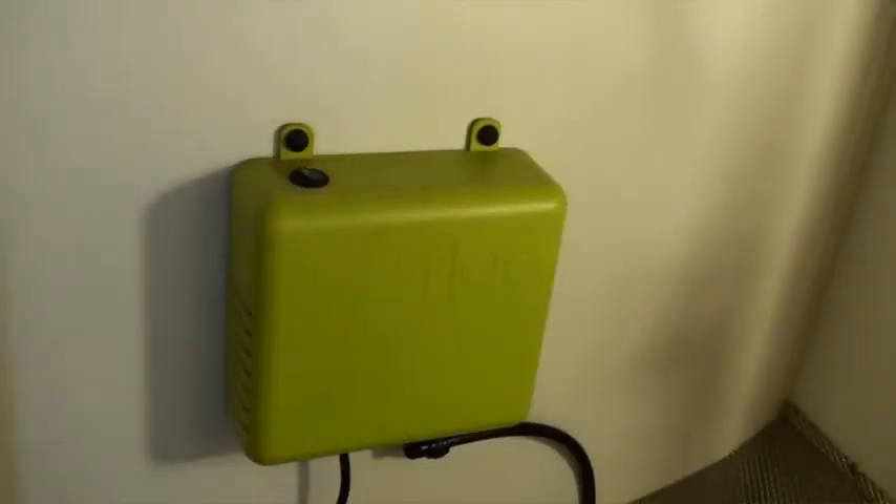So it's time now to do our first drain down. When you switch Flow on for the first time in any drain down, it will only take about three to five seconds to build up air pressure, and then it will stop. Now this might seem a little short, but it's perfectly normal. Remember, your system is full of water, so there isn't much space for air to be pushed in at this point. But when we drain this first outlet, it will clear enough water from the pipes to allow much more air to be pushed in, and this is what gives us a better drain down.